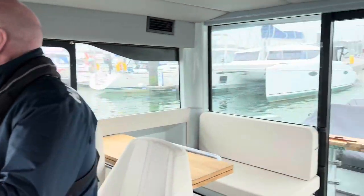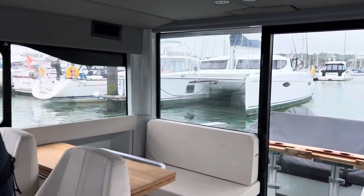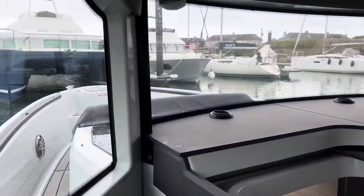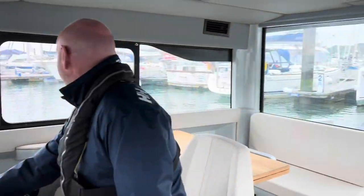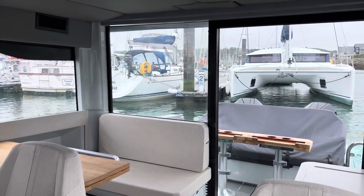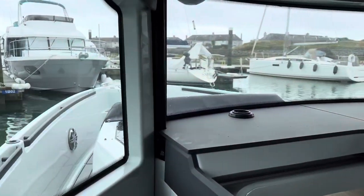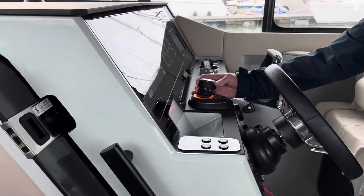As you get more shelter or more wind against you — like now I'm starting to go backwards a little bit — I'll gently edge the joystick forwards to counter that. When you lose a bit of the wind on your bow, you'll be overcompensating, so you just have to square yourself up to the pontoon and manoeuvre the boat in real time accordingly. Now I've gone a lot more sheltered here, so I'm just going to slow it down a bit and turn the joystick to square it up.